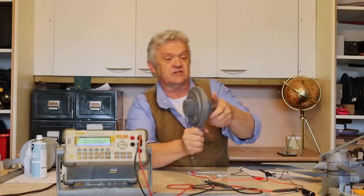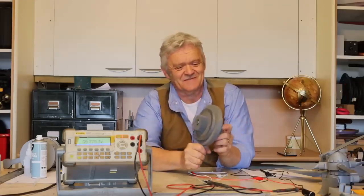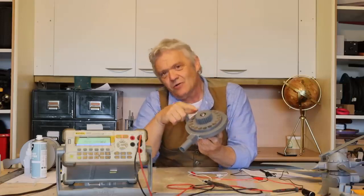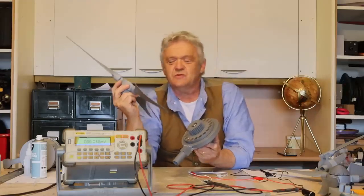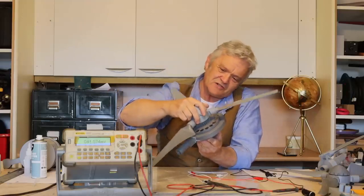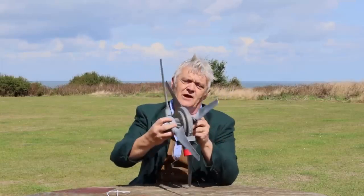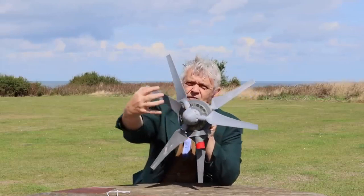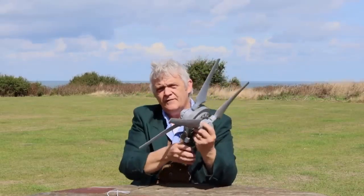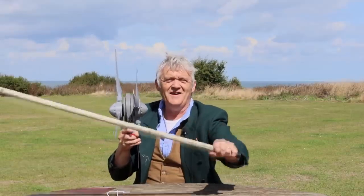If I give that a spin by hand with a meter connected, we get a reading — so it really is that simple to make. These cog connectors let me do things in a modular way; the cog fits the earlier wind turbine version and we just slot it on to have ourselves a wind turbine. The blades have to go in that orientation with a 60-degree offset. The blade has a crease indicating wind direction — it works best if wind comes from one side, though it'll still work from the other.